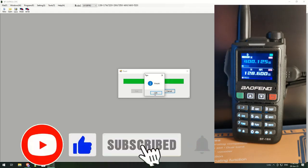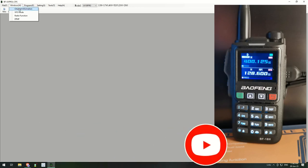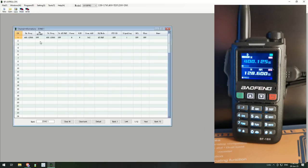Okay, that doesn't take very long at all. So first of all, let's go into the channel information. There is one channel in zone 1, which is UHF. I think there's another one as well. Let's go to the next bank. Oh, there it is. It's in the 200 megahertz, 1.25 meter band, in bank number 2, or zone number 2.